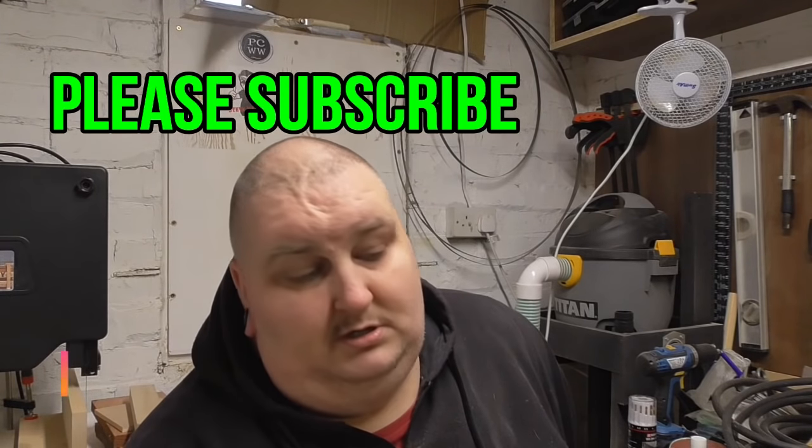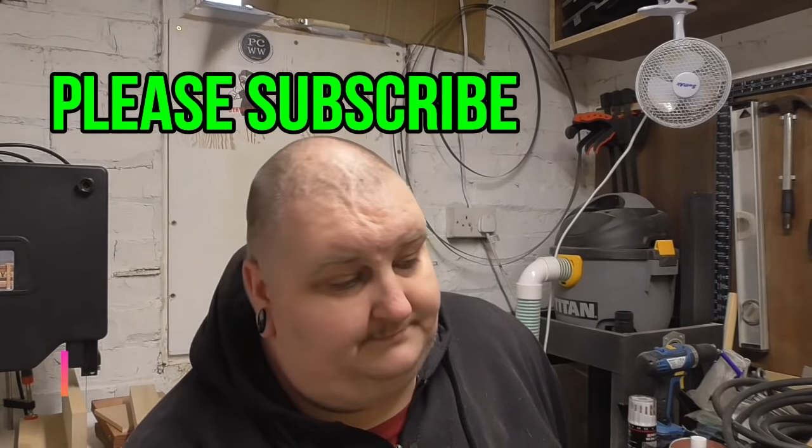Hello my friends, thank you for joining me today. What we're going to be doing today is a scroll saw video. As you know, last week's video I was having one or two problems with the scroll saw. I completely stripped it all down, cleaned all the bearings in it, and gave them a light greasing again. The problem of the knocking and the banging and the squeaking seems to have gone. I'm still getting a slight vibration on the machine, but it's workable for now.